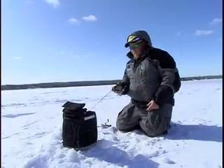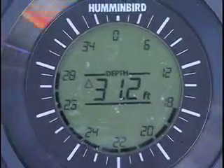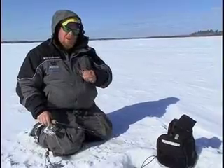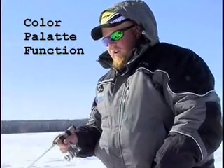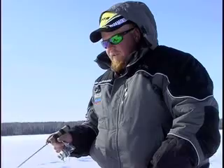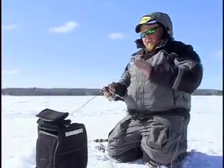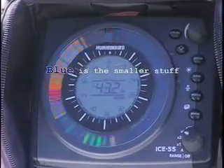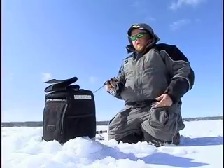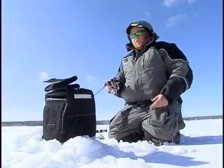Let me explain some things about it. This is a flasher, but it's got an LCD readout in the middle, and at my fingertips is all the information I need. It shows how deep it is with no confusing numbers. You have three different color palettes. You can go three colors or six colors. The nice thing about six colors is you can get really detailed — a gradual taper from blue being the smallest to red being the brightest, and all the spectrum in between. Everything in the water column has a size, and this helps you sort it out really fast.